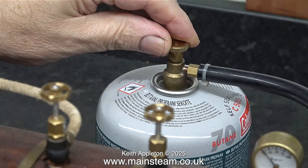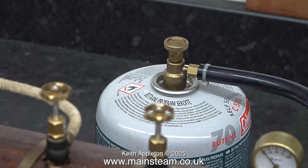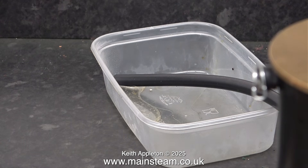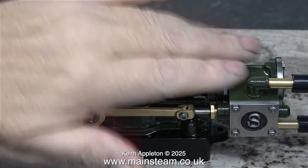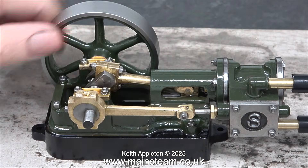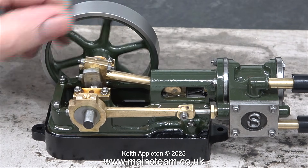There's a tiny bit of pressure but not enough to make the engine work. At this stage I turned up the gas valve on the gas tank. This is the exhaust pipe from the engine temporarily emptying into a food container — I'm doing this so I can see how much oil is in the mix. The cylinder of the engine is now getting very hot indeed, it's a bit too hot to touch, and to avoid any hydraulic lock I'm carefully rotating the engine.